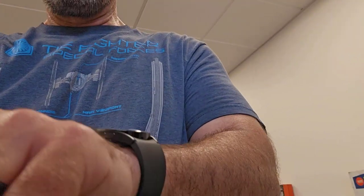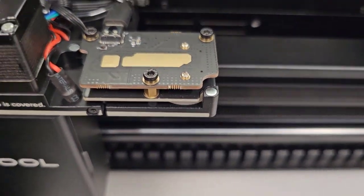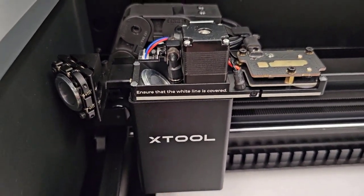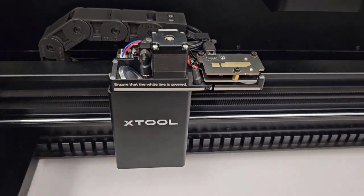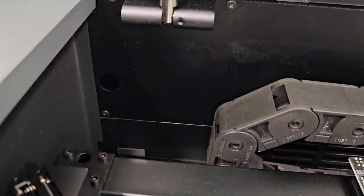Some unique things about this laser: once I removed the top of the head — which is held on with magnets — you can see there's another mirror in there, a servo motor or stepper motor for autofocus, and a board for the camera. There's also a hose for the air assist, which helps you cut better and keeps smoke from going up inside where the lens is and getting the lens dirty. Smoke could get to the other side of this mirror, so you have to clean those as well as the lens underneath the head and the camera at the bottom of the board. Back in there is another mirror where the laser comes out of the tube, bounces off, and comes through — you should probably check that now and then.